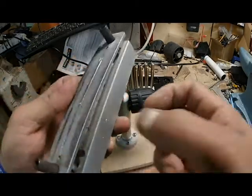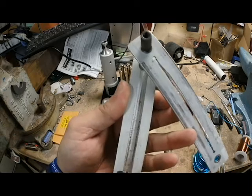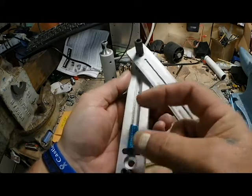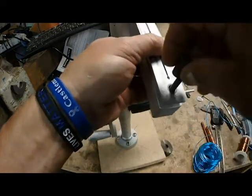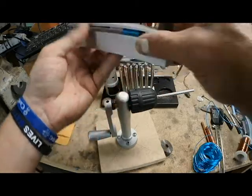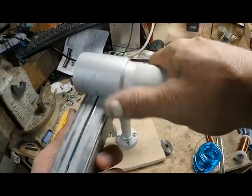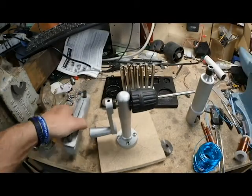You coat it, then take it over here to the cutter - I'll open this up for you. As you can see I've been using it, it's all dirty. There's a spacer at the bottom made of a softer rubbery material. You take your coil and put it in here, making sure the side you applied wax lubricant to is down. You snug that side up - not too much tension - keep them level, then insert your cutter. I have a foot pedal for my Foredom, and you run it and come through and it cuts nice little rings.